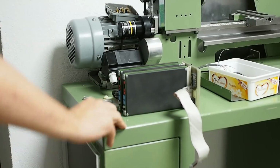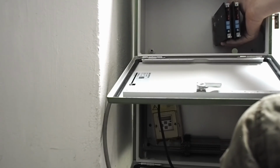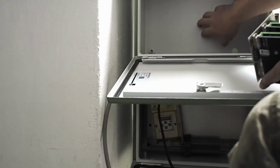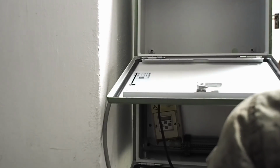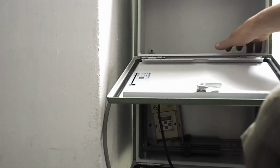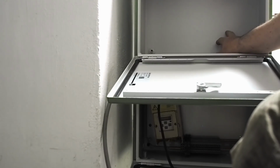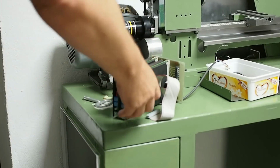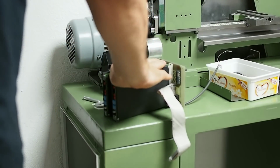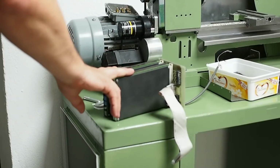One issue I have is that these stepper drivers are very, very deep. Now, if I mount the back plane for this cabinet in its normal position, I'm not going to have enough space to close the door. So I'm going to have to make a couple of spacers to move that back closer to the wall. That's not going to be a problem. But I really need to get these steppers mounted with their cage before I can do anything permanent running up through the whole cabinet. So yeah, I guess doing this in the cabinet is probably one of the first jobs.